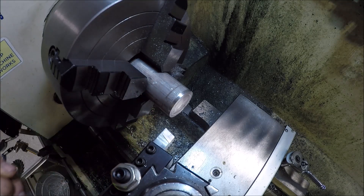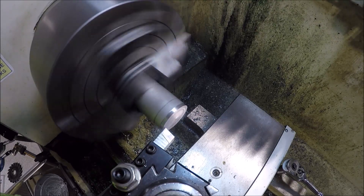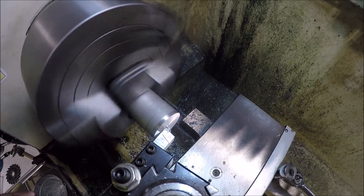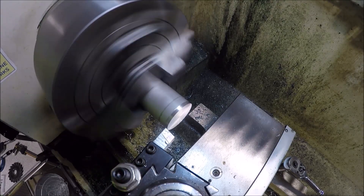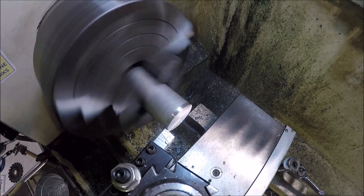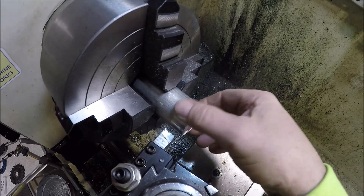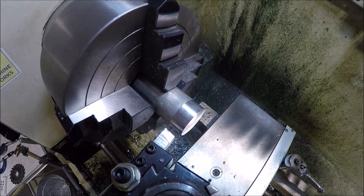Got a piece of that one-and-a-half-inch bar stock — let's go ahead and make that half-inch thick spacer. We'll continue with the high-speed steel, get this face cleaned up, and then bore it out to a one-inch hole. Just need to kiss that outer edge — high-speed steel did nicely. We'll drill it and then bore it out to a one-inch hole.